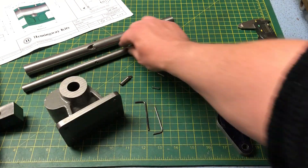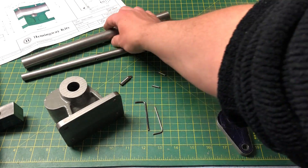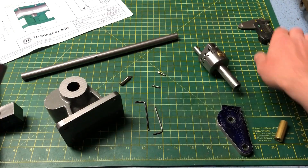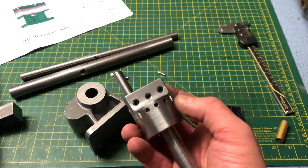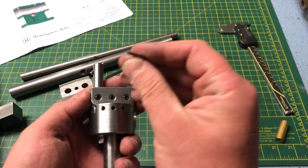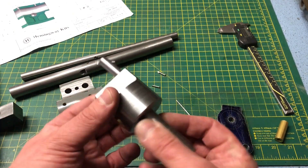That should get me to the stage where I can use this larger 7/8ths bar — exactly the same process, but now with a quarter inch cutter and an angle that advances by 18 thou. I am going to bore the hole for the tailstock bar as well, but this time using a boring head held in the lathe. And I'm going to stick with the boring head to machine the spigot, but this time I will need to spin the cutter around to face inwards, and then run the lathe in reverse.